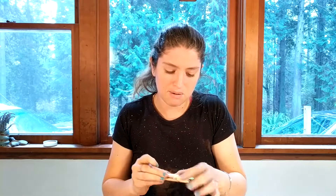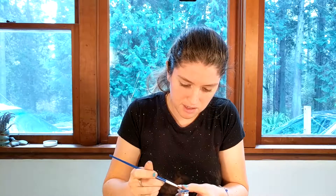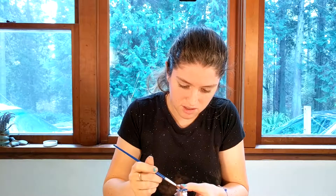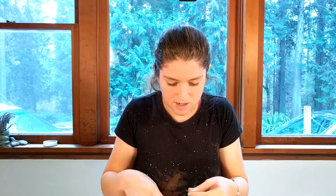I've found it works really well if you add a little bit more conducting paint and then tape over the conducting paint. So I'm going to add just a little bit — not too much, you don't want a ton of conducting paint — but just a little bit on the top of the battery here so it'll help get a really good connection. Then I'm going to get another piece of tape and go right across that paint.